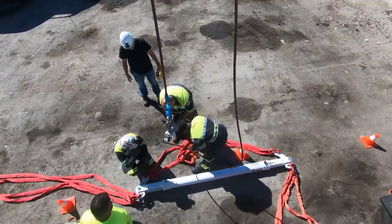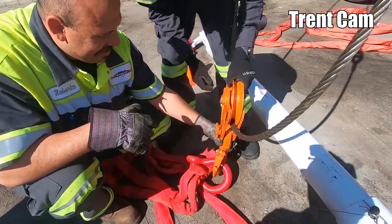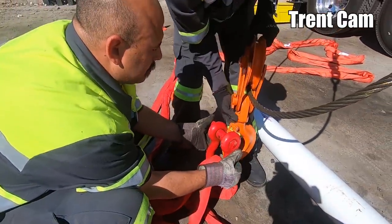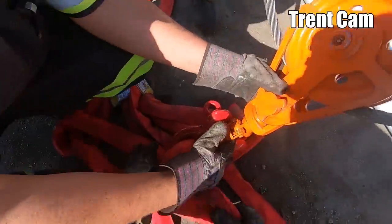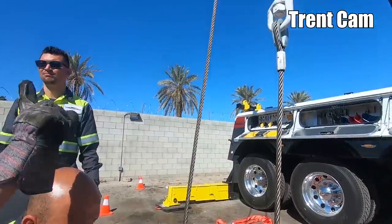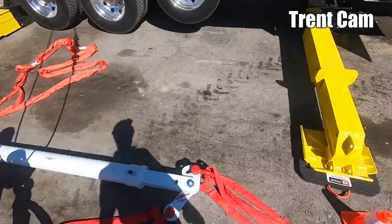I'm gonna wait till you pull it up. That needs to go the other way. Shackle? Yep. Bolt goes on that. The straps are down here. If it was a single strap, it doesn't matter, but in this case, see these lines? You have a 45 and 45. This is rated for a side load, so you can have the straps down there. Are you locked in dead or free? It's okay. Should have enough weight to cable out with all this.